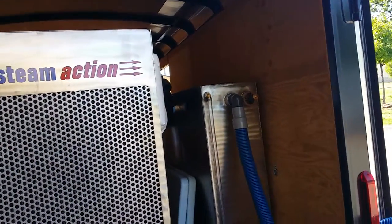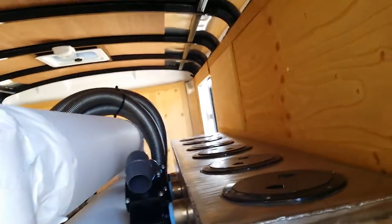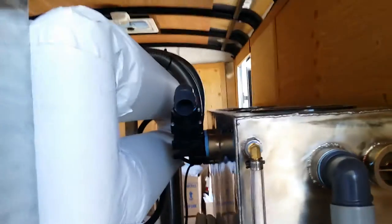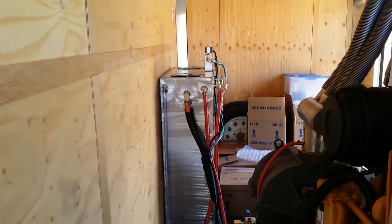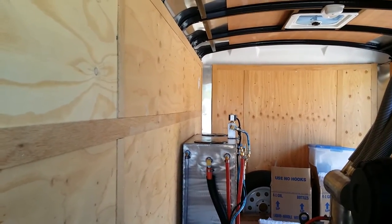It comes complete with this — this is your vacuum tank. The vacuum tanks run from 200 to 300 gallons. You have a baffle partition between each of these caps? Yes, we have to — otherwise it'll collapse. And your fresh tank is also anywhere up to 200 to 300 gallons, whatever size they need. That solenoid on top is a special safety system: when the water gets above 240 degrees, it automatically goes back into the first water tank.